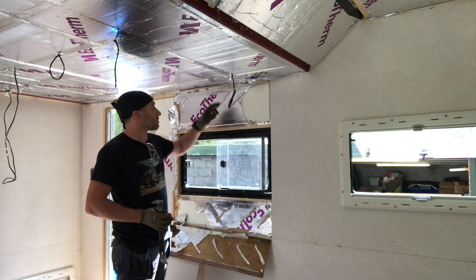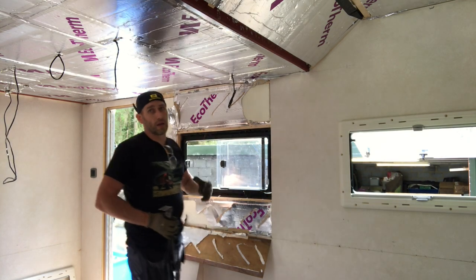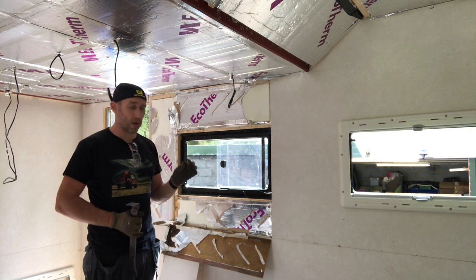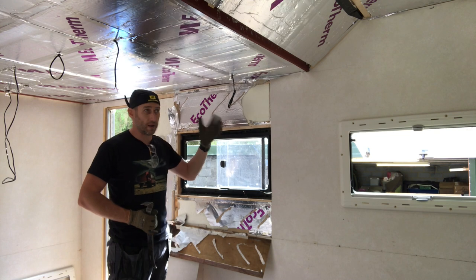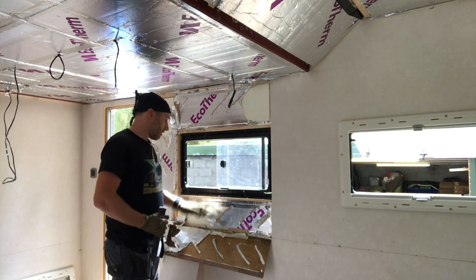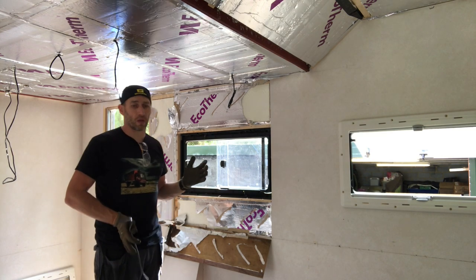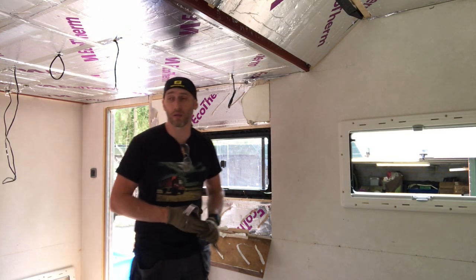I also want to add some insulation because there's steel up here, and if you don't insulate that steel you're going to get cold bridges - you'll possibly get condensation on the walls where the steel is, and maybe even mould. So you really want to get that steel insulated, or have a decent sized bit of wood between the steel and the inside environment. All this is coming off. I might add more wooden structures where I'm going to be putting cabinets, then 9mm ply, and the final finish will be a white gloss plastic, kind of acrylic or something like that.